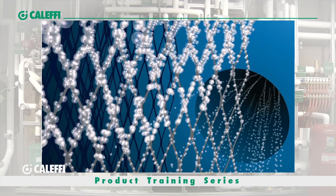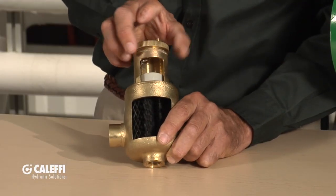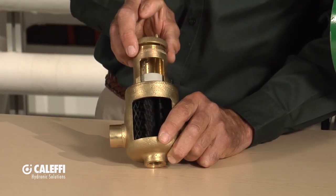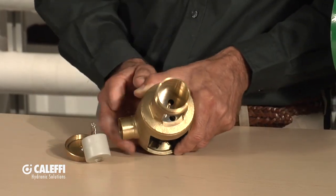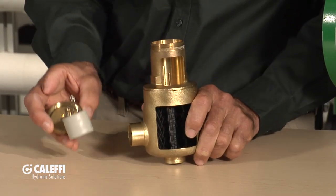The bubbles cling onto that media, and the small bubbles form into big bubbles, and as they get more buoyant, they rise up and come out the vent in the top. Moving up to the top — another thing I like about this one is you can disassemble it and get in to service it. Some competitors just seal them together and there's no way to service this, because in the top here are some really unique features. If you look down inside there, you'll notice there's a pin in there, and what we do is we pin the float.